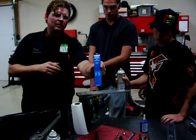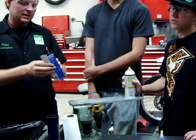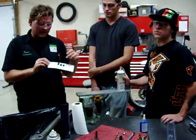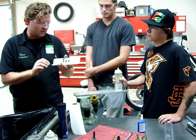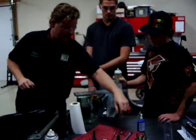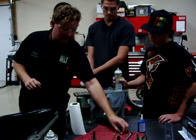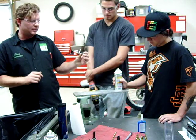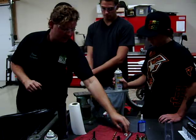This brand is really popular, used throughout the industry in all applications — a lot of different uses. These come with good directions if you haven't used this before, so a do-it-yourselfer can do this as well. We're going to be putting a helicoil in a piece of scrap aluminum with the idea that we're going to be able to torque the six millimeter fastener back down to the common six to eight foot-pound torque spec known in this industry.